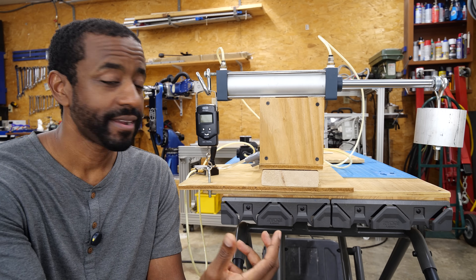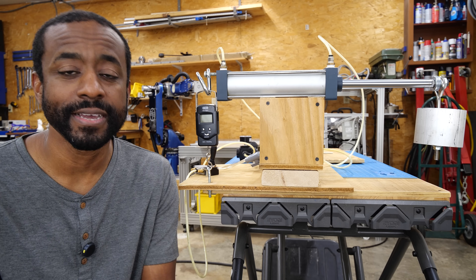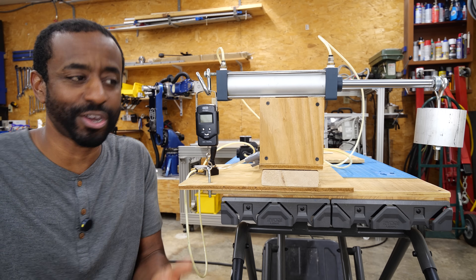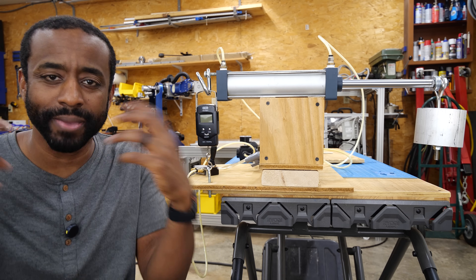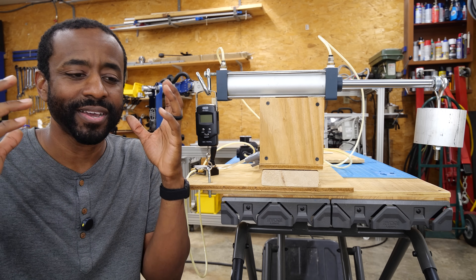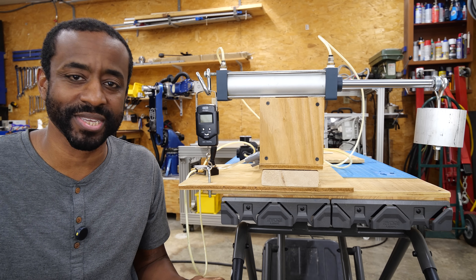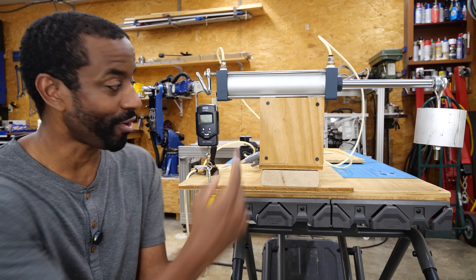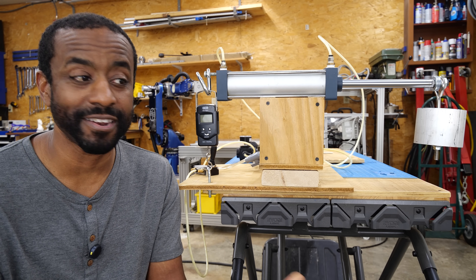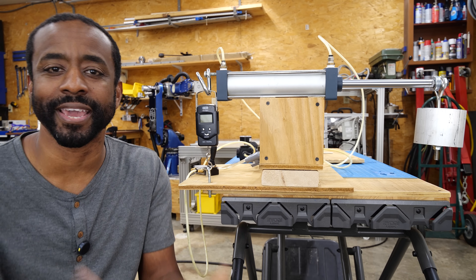You might be unbalanced. This is pretty easy to see in this two-dimensional representation of the concept, but it can be pretty deceptive, especially because most of the time you're designing this in CAD. You're making a 3D model first and the 3D model is static — it's not moving. If you don't remember to position the model in all of the possible configurations you'll see it in, check the center of gravity, and make sure all the forces are appropriate in all positions, you may end up with a machine that breaks on you unexpectedly because forces suddenly doubled in a way you didn't expect.